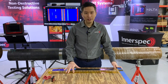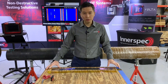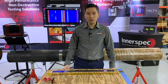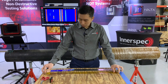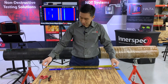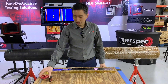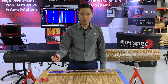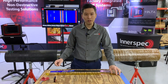To adhere the double-sided tape to the Magnetostrictive Strip, first we need to cut the Magnetostrictive Strip to its required length. For this particular 8-inch pipe, it's approximately 27 inches in length. We'll need the double-sided tape as well, which we cut a little bit longer than the Magnetostrictive Strip. We need scissors, and also something flat to remove the bubbles from the double-sided tape after adherence to the Magnetostrictive Strip.